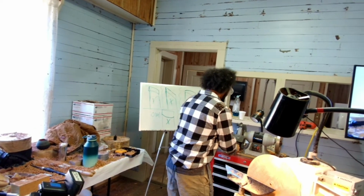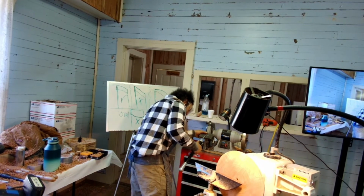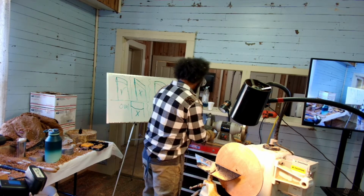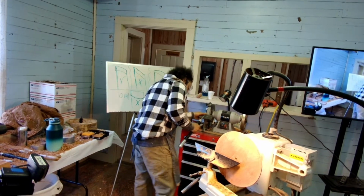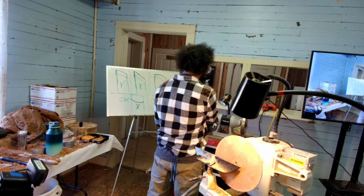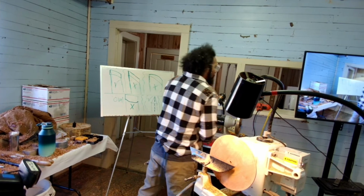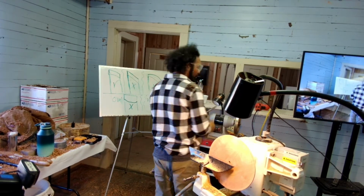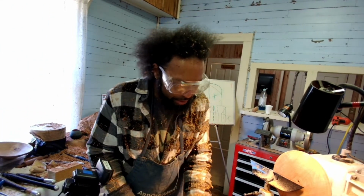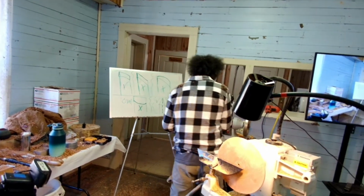I'm going to go ahead and sharpen not the secondary bevel, but the micro bevel, the actual cutting edge, right now, and that'll be good. I'll be able to use this tool probably the entire time, all the way down. So that's nice. And all I need to do when I'm freehand grinding a tool like this, if we can take a look, it's platform ground from here to there, and then I switch over to the left hand from here to there. So when I have my left hand on the tool here, I'm grinding the tool this way. It's kind of like this, and then the right, like that. I'm just touching this up. Again, I'm never starting at the center of the tool on the nose.